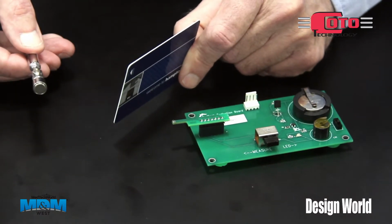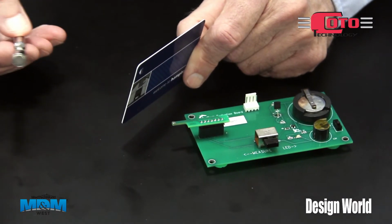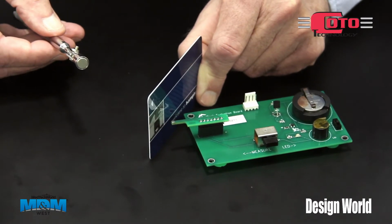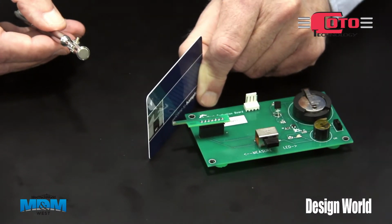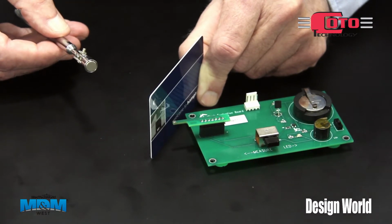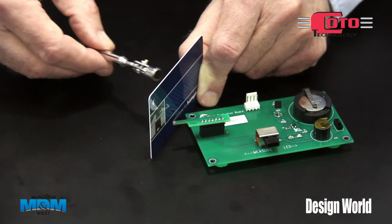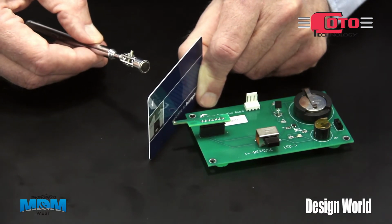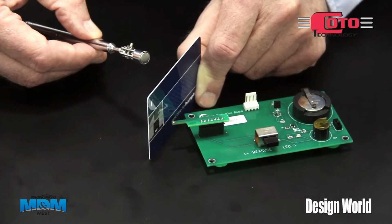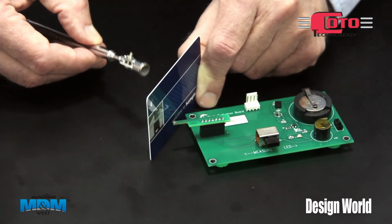Another example is a capsule endoscope, which is a sealed camera that people swallow to image the intestine. Again, those kinds of devices can be operated by one of these switches. The switch can be sealed in with the battery during manufacture, and then when the patient is ready to swallow the pill, the switch is operated, starting up the microprocessor and the video systems that pick up imaging as the pill travels through the body.